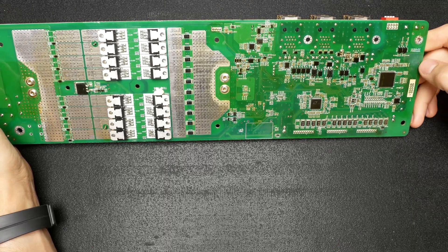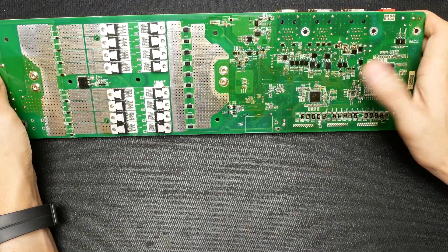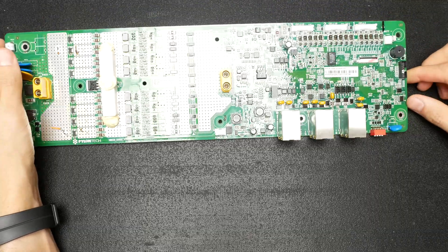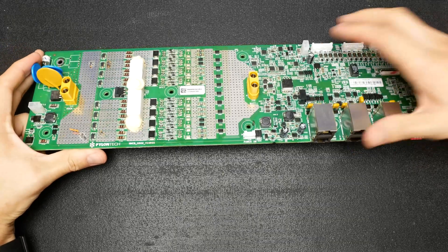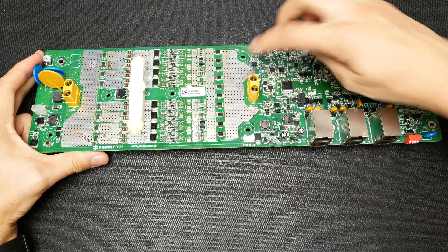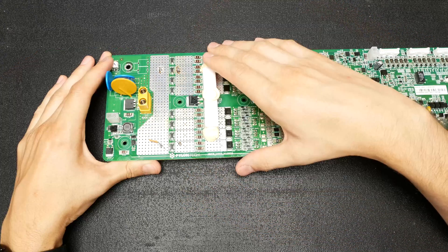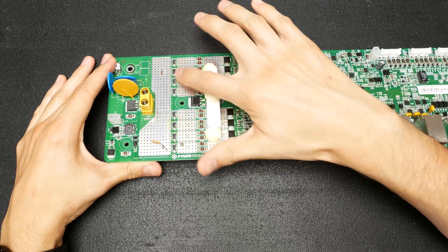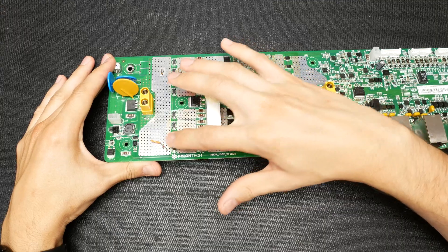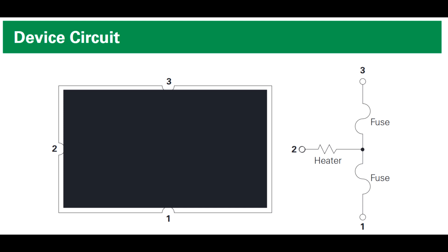The big integrated circuit on the right appears to be the main controller. The smaller TQFP in the middle appears to be the balancer. On the left we can see the charge and discharge MOSFET switches. The negative wire from the battery packs connects here. There is a bunch of shunt resistors in parallel, then more resistors — maybe used as ballasts. This is the protection circuitry for the MOSFETs, and these are the failed fuses. These are not normal fuses: they have a regular internal fuse element rated for 30 amps, but additionally they also have a resistive heater that can be used to trigger the fuse on demand, even with no current going through it. This way, if the switching MOSFETs fail shorted, the BMS can still trigger the fuses and protect against a catastrophic failure.